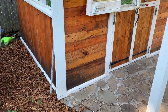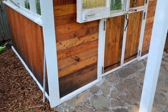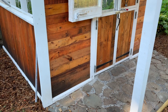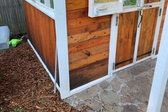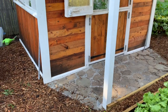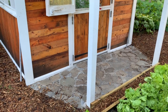Then I dug the center out. There was sod with topsoil, and I dug all that out. Then I dug down about another foot and a half, past the clay layer. Here on Long Island, the ground didn't absorb moisture as easily as the sand, which was about a foot and a half down.